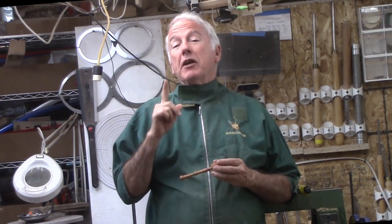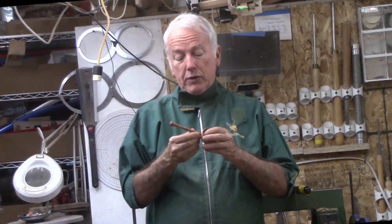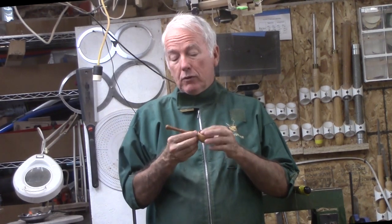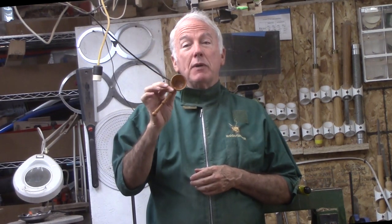Sally caught me at lunchtime and said, 'You didn't attend my presentation.' I said I was sending my wife instead. She said, 'But then you won't know my special tips and tricks.' Well, I got some from my wife. The most significant tip I will totally reinforce is this one: it requires that you drill a hole for the handle into the bowl portion. Whatever you do, don't wait until the last minute to drill that hole — you will regret it. At least do it before you sand, but even before that is probably better. I think that's one of her big tips.